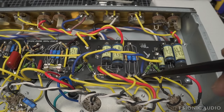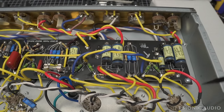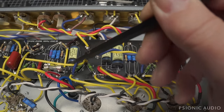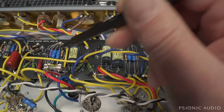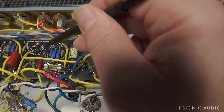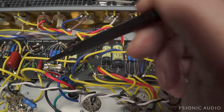And in normal operation, there'd be a tube in each slot, V1, V2. This one does not have one in V1. And this blends the signal at that point to just one signal. It goes through this cap and then is fed through this 500 picofarad to the reverb driver stage. And there's a wire beneath the board from this junction right here to right here, and that brings in the dry. And it's all mixed together over here.